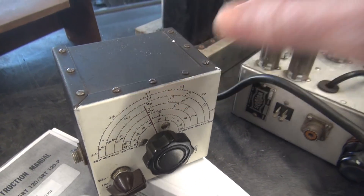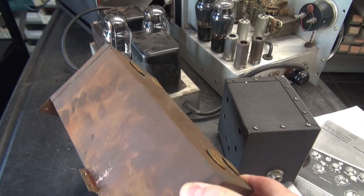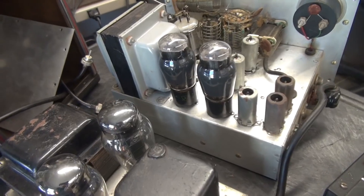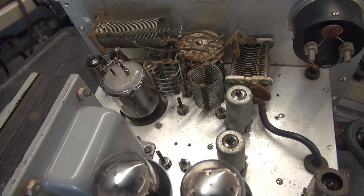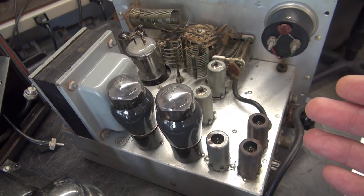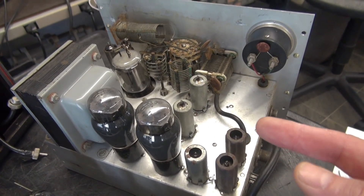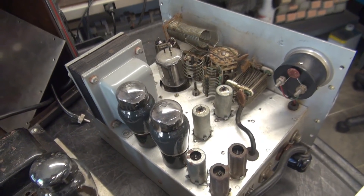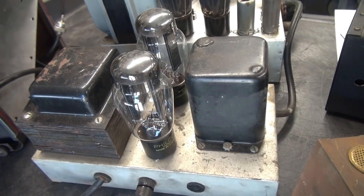This piece is probably the rarest of all. This hunk of copper with the vents is actually the cage to the RF output tube — I've already removed that. The top of the chassis is pretty compact construction, kind of reminds me of a Multi-Elmac type system, because Multi-Elmac also did not have their high voltage power supply in the transmitter. I think this was because they would also run these things mobile — I found information that Sonar made a dynamotor power supply for this transmitter, and it said because of its small, convenient size you can bolt it to the firewall of your car.